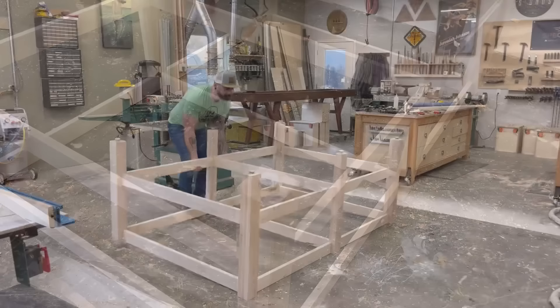I repeated this process on all five of the other legs. Then you just screw the little bracket in place with three small screws and thread in your leveling foot. These will come in handy when it comes time to get this all flat and flush with our table saw. With that step out of the way, I flipped the whole thing back over, and it was time to start fitting all of our plywood panels.